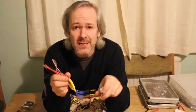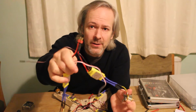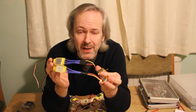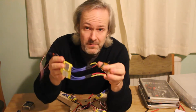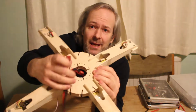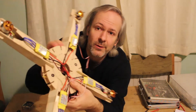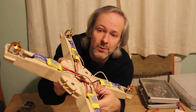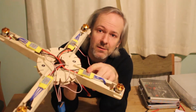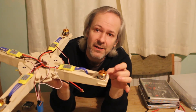After a busy couple of evenings I've wired up all the motors. I've wired them in pairs, then wired each pair to a common Dean's plug. In each pair, one motor goes clockwise and one goes anti-clockwise. I've got four pairs, allowing me to go up to an octo. To connect the power together you can see here I've got a four-into-one adapter. I've configured this as a quad and provisionally taped the speed controllers down — they look okay.